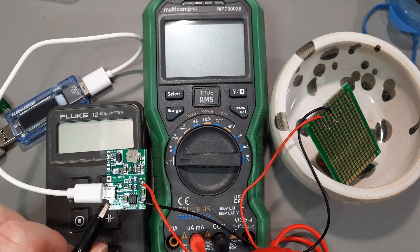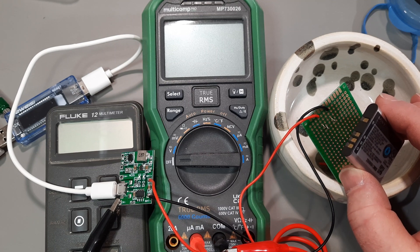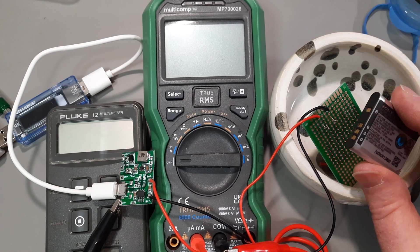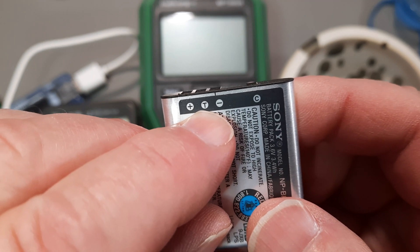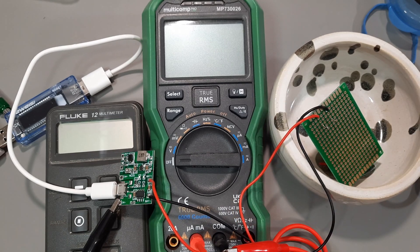In summary: it worked, it charged the battery, and the camera worked. Would I recommend doing this? Only if you're desperate. Would I walk away from this while it's charging? Not a hope — I'd have a hard time explaining to the insurance company if the place burned down. This thing really needs to be used with a battery that has protection. One more thing: the T pad is for the NTC thermistor. I checked this one and it's got about a 100kΩ NTC, so that's kind of cute. That's it for this one — the camera works, the charger works. You might not want to do this at home. Have a good day, bye!